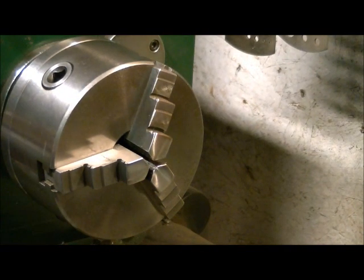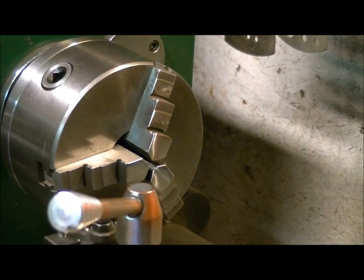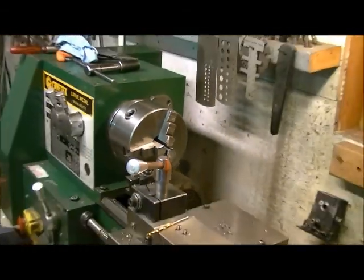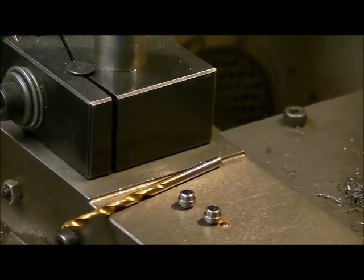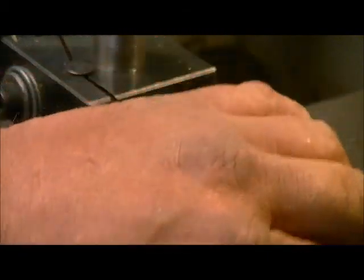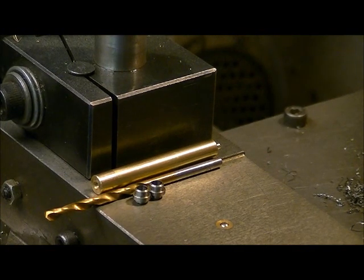Those are our results — these transfer ports can be put into even a 2240 or right into the 1377 Canadian version, and you'd be able to increase your power a little bit and still stay under 500 feet per second without having to worry about anything. That little extra bit you get, close to that 500, helps with energy, helps with distance, helps with accuracy — they're all pluses. With pistols in Canada you want to keep them under 500 fps, and this is still a really good way to do it. You can do it in small increments too.